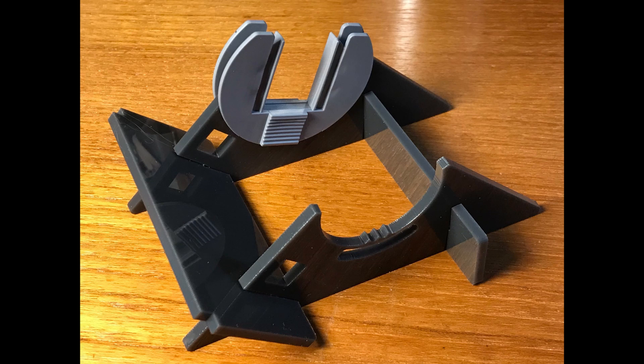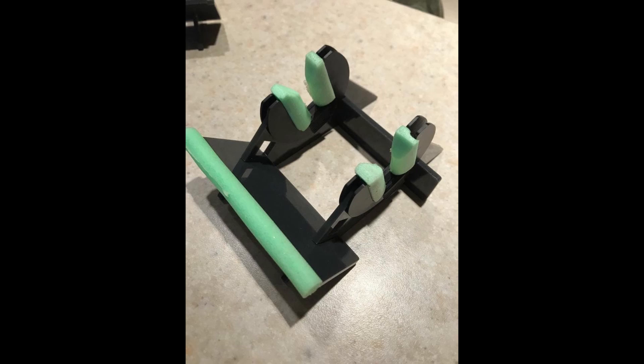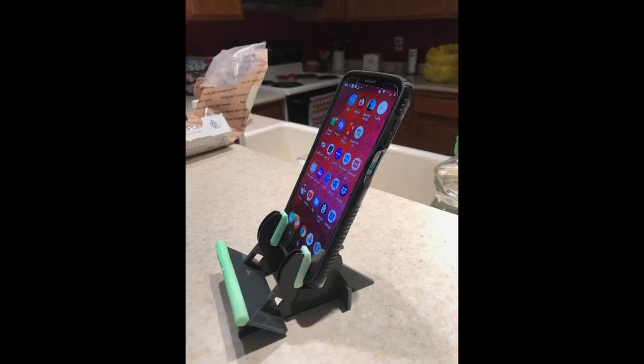I sent three sets of parts — both injection molded and laser cut acrylic — to the customer for approval. From the photos you see here, the first photo is the assembly that I did, and the second and third photos are after he received the parts and put on some foam. You can see how it's being used to hold a cell phone or tablet. He's very happy with the parts. I still have issues getting the second part out of the second mold, so in the next — and probably last — episode, I'll add ejector pins to the second mold to make it a lot easier to get out the parts. Then I'll produce a batch of parts and send them off to the customer. I hope you enjoyed this episode — please give me a thumbs up, subscribe, comment below, and I'll see you next time.